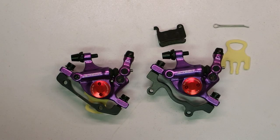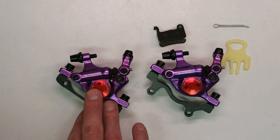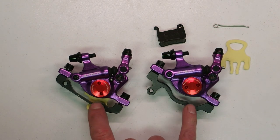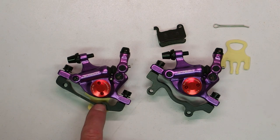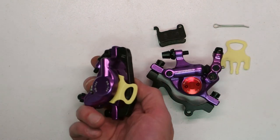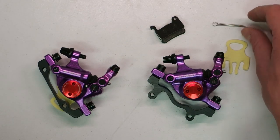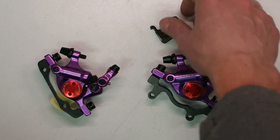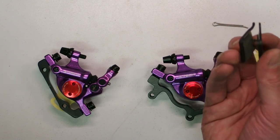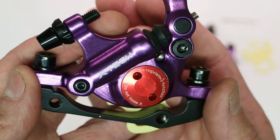So everyone's subscribed — here is the hero of our video. This is the front caliper, this is the rear caliper, or at least that's how they're sold, because they differ only by the adapter. This is the 160mm international standard mount, and this is the 140-to-160mm adapter. The brakes come assembled, but I've removed the pads to show you the pin, the pad spacer, and the pads themselves. The pads are standard Shimano-compatible, pretty common, so getting replacements won't be a problem.